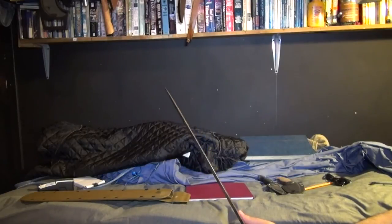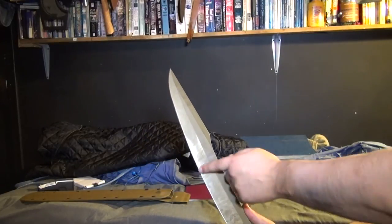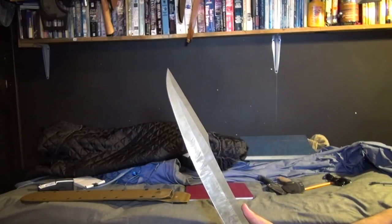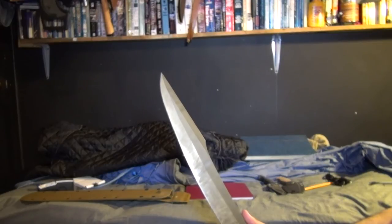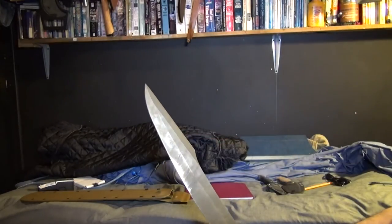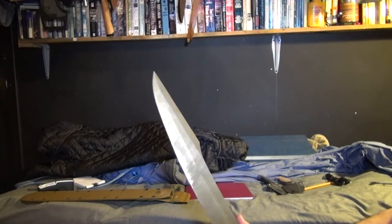I think I'll use this for a while and check. Eventually once the coating wears down enough, I will probably regrind it as I've done to some other blades. I'll take the angle of the edge down to around 12 degrees per side and then run a micro bevel on top of that, reducing the thickness to around 25 thou in the heavy chopping area, down around 5 thou in the carving area, and I may take the tip down to around 15 thou — depending on what I'm going to use the blade for. If I can use the back false edge for the heavier limbing, I'll keep the tip area at around 15, but if that doesn't work out I may leave the tip closer to 25 thou so I can do harder limbing.